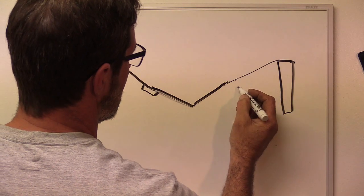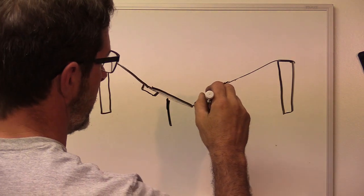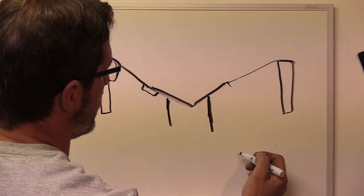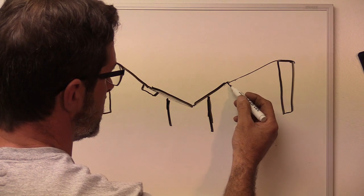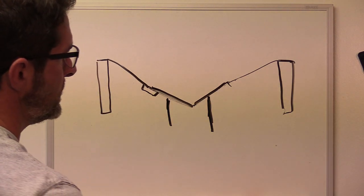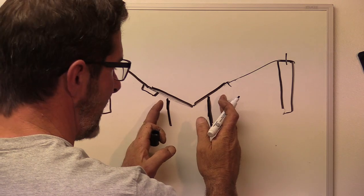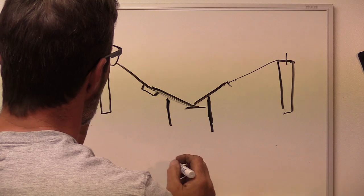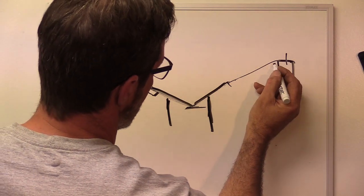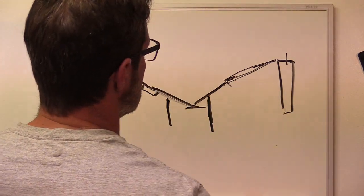But then I have to independently support the keel, with the back square and level to the ground, and the sides blocked up all the way around to the right height. Cut all these tacks close to the back. Obviously the furthest back tacks don't have to be removed. And independently set this angle of the keel, clamping it here, clamping it there, having the keel set level, front to back, at least in the center. Have these heights set on the stand, which is essentially making a full-size jig. And then wherever this piece hits, if it comes down and it hits the top of this metal, and that's right, then that's where it has to be.